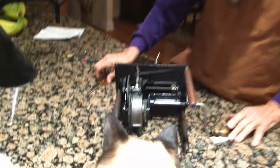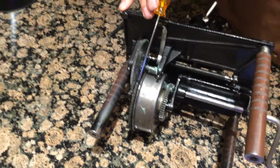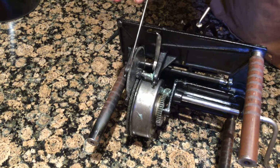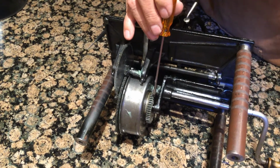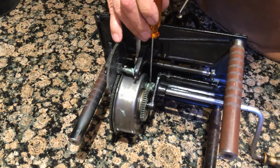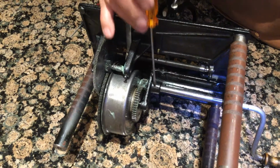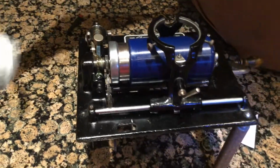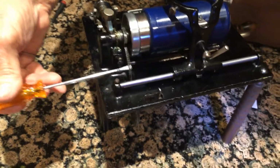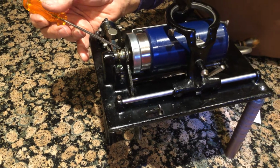Now I'm okay. I greased this gear with a silicone grease. I greased this gear, the cranking gear for the spring barrel, and the ratchet gear back here, and the inside of the casting. I discussed that on another video. You want to do that. The other gear, this main drive gear, I oil it, but I grease the governor gear with a silicone.